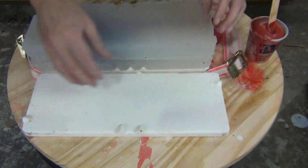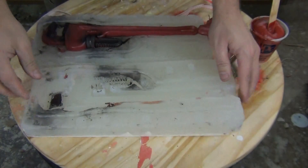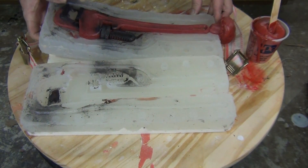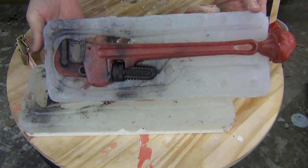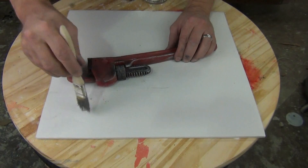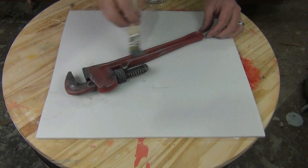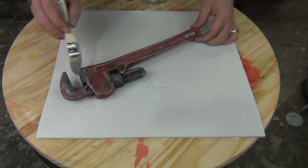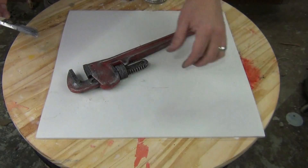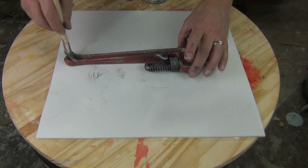There you have the process of casting a TC-284 flexible foam wrench. In a future video I'll follow up showing this poured up with the different 30 to 100 ratio, so you can see the difference between those two foam formulas — the eight pound density and the 13 pound density. The main reason I didn't do it here is because that does result in a softer foam, and I wanted this to be fairly firm so it wouldn't wiggle around too much. We're going to follow this up with a little bit of dry brushing with some of that silver bee, and now we have a nice realistic, inexpensive foam prop that takes a very small amount of flexible foam.